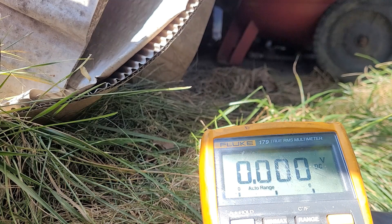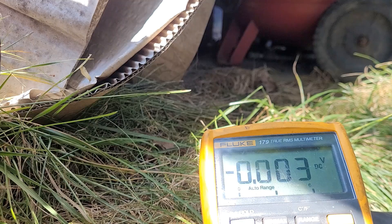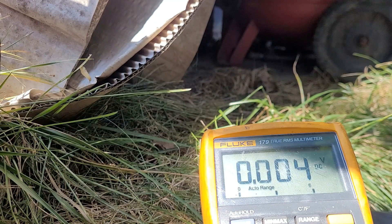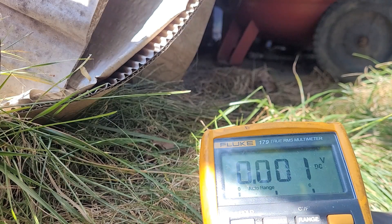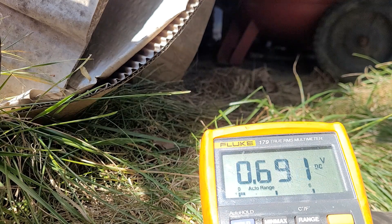I had it backwards so that's showing negative, but basically these batteries are sitting at - even after charging for a small amount of time - less than one volt. We're at 0.6 volts. I think those things are pooched - they won't hold a charge anymore.